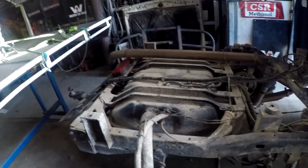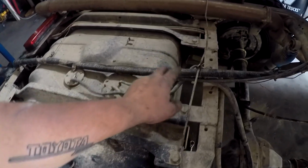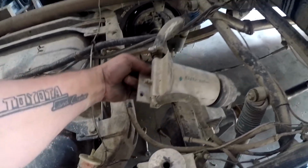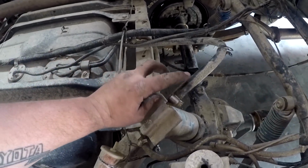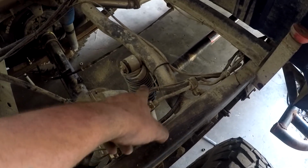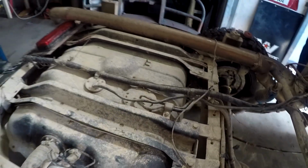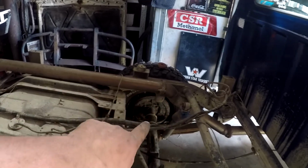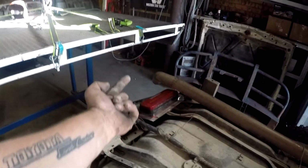Here's the big fuel tank, the big 140 litre. So that's our VDJ tank. And all I did to make it work is put a Donaldson filter in line to bring it down off the VDJ size, and the out goes up to the dual. The 12HT has 2 fuel lines, in and an out. So your out goes back to the tank, but it's also a cross member I put in, and you've got my exhaust pumps up through the suspension, over the tank and out the back.